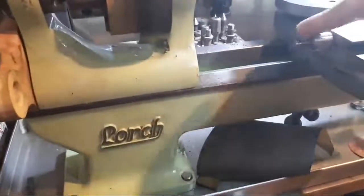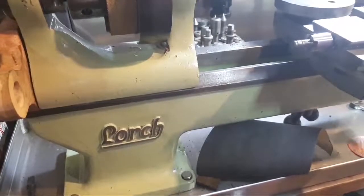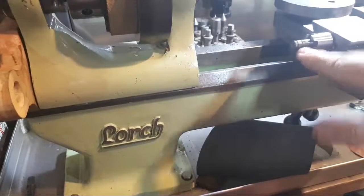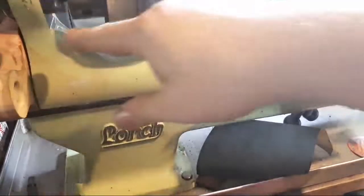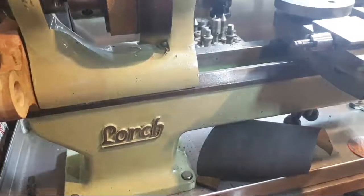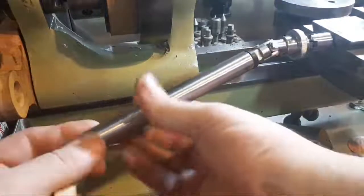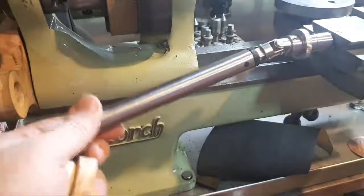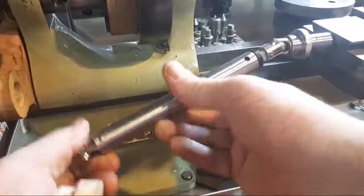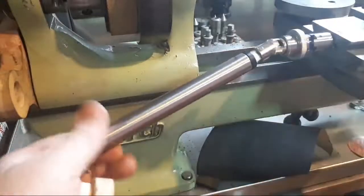If we go back here, I've added this piece here. We drilled this out during the week and we fitted this with the dog clutch and this pin, which I hardened today with the 2 grooves in it for the ball detent. So the thrust bearings in and fitted. If I can find the second one we made, I might show you next week, but this week I haven't got a clue where it is, to be honest. I'm sorry about that. This just pops on here and it locks in that position, which is out of gear. And in that position, which is in gear. And that moves the compound. So the way that works,